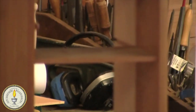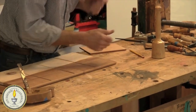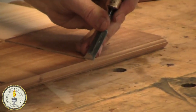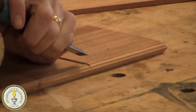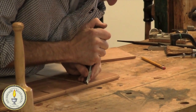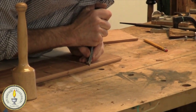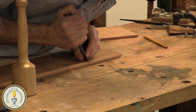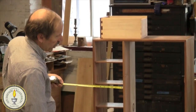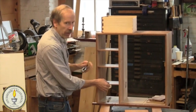That's the actual existing thickness — not quite all the way to the bottom, but almost. That will give you a place for the waste to go away. So I start from the middle and I work my way out to the end, left and right, back and forth. I checked the inside distance again as I went down, went back to my shooting board, and just kissed the end of these with a shooting plane so that these guys would just fit just right.